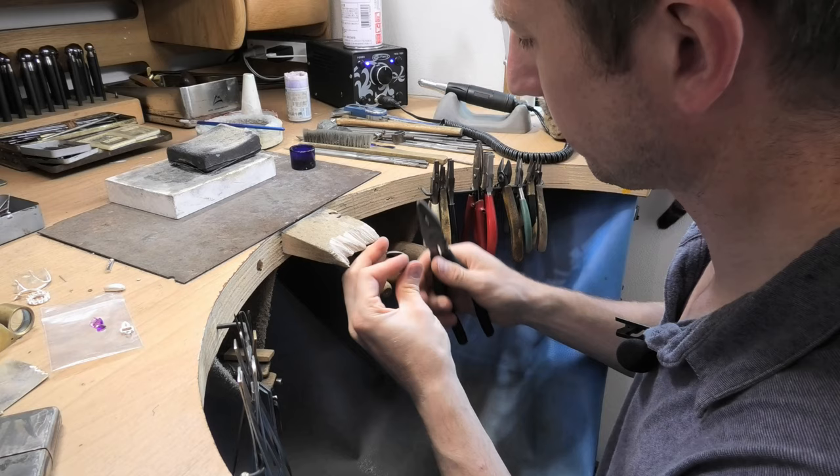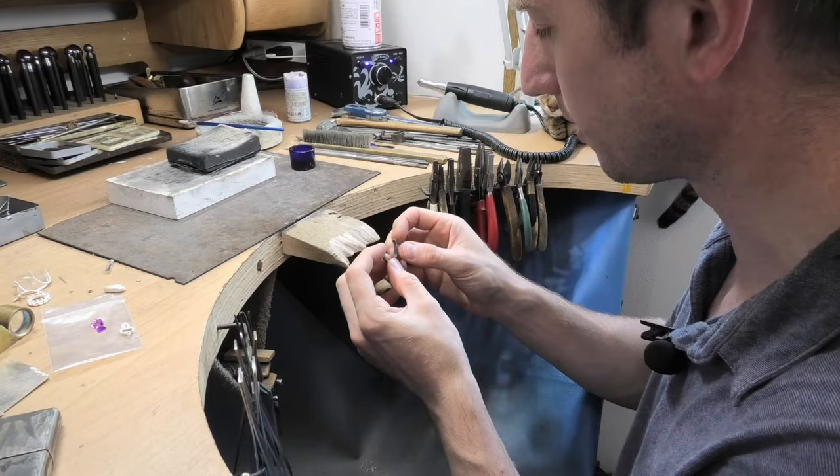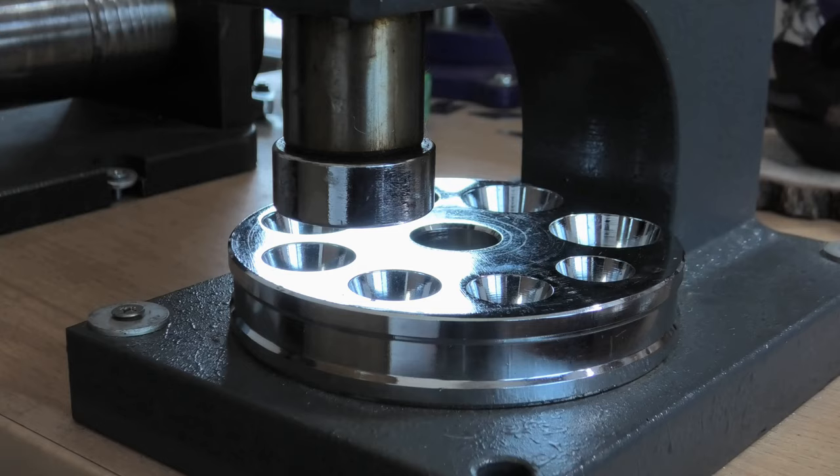That's gone really hard straight away — problem with melt-ups, everything goes really hard really quick. But anyway I'll anneal that and then continue — do what I said: turn it up into a circle, get it nice and flat, get it perfectly round, and then fire it up, cut it through the solder join, open it up — Bob's your mother's brother.